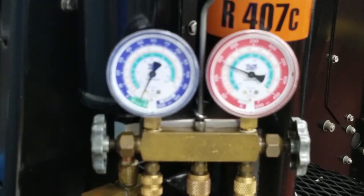If the pressure rises and comes up to zero and stops there, that could indicate an outside leak — zero on your gauges is the same as atmospheric pressure. If the unit cannot hold the vacuum and the suction pressure keeps rising until the discharge pressure and suction pressure are about the same, that indicates an internal leak — most likely a valve plate leaking internally. Under normal conditions, when you pull it down to a vacuum, it should hold.